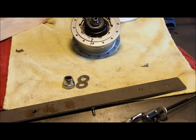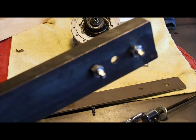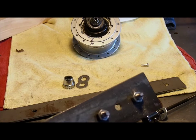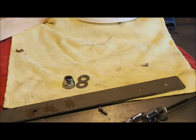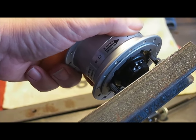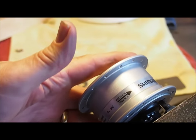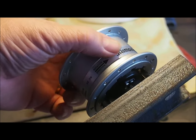I'll show you what I'm planning to use now. I've got a good beefy chunk of channel iron here into which I have inserted a couple of 5/16 bolts and I've filed the tips of the bolts. You can see these notches here — I've got these bolts lined up and filed to fit. It does fit. The theory is that we'll be able to unscrew that ring.